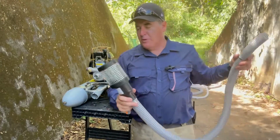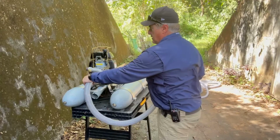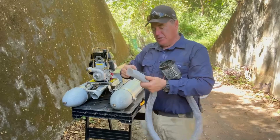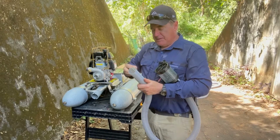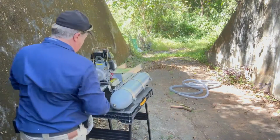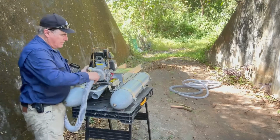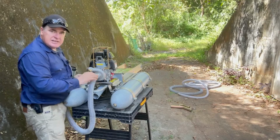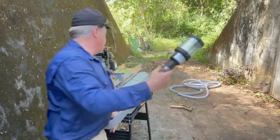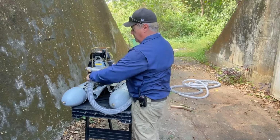Like I said before, this is quite good. This is your suction that primes up the pump. Right, so this water goes in here. It's the same as a turbo on a car. They're really specialised pumps that Keene's do, which is bloody amazing that they can make their own pump housing, and it puts out so much flow. And they've worked on it for years to get the correct amount of pressure, flow rate, everything. Like, it's a work of art. People don't realise. They think, oh, I'll go down and buy a normal pump.